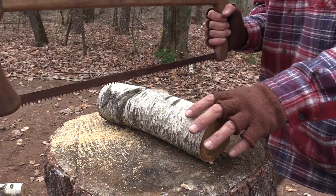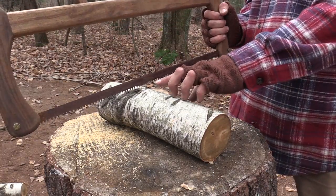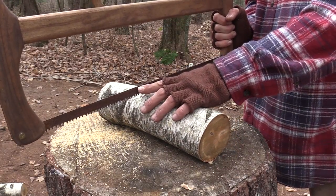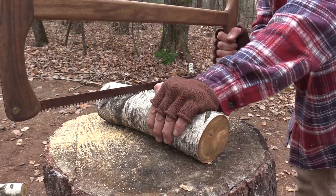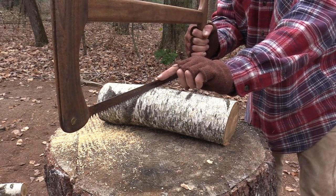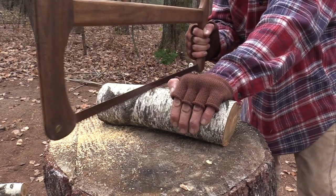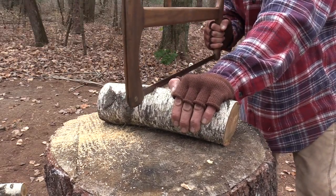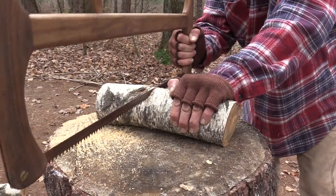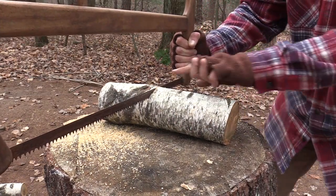What I like to tell individuals to do is use our saw blade as a depth gauge. Identify first where we want that maul head — right about here — and all I'm going to do is saw in until the saw blade is as deep as it is thick. I'm going to run the saw blade here, taking my time. Now you can see that center section is almost there — another stroke, and we're there. That's as far in as I want to go.